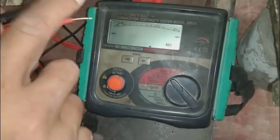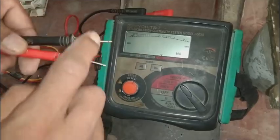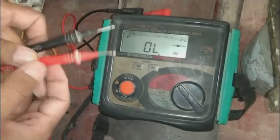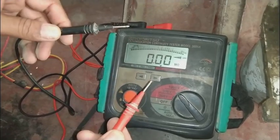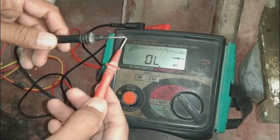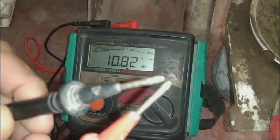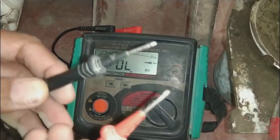While testing on 500 volts, do not touch the probes — this is a safety point. We press and turn the knob; now it is ready. If we connect these probes together it will show zero, and when opened it shows out-of-limits. The probes give a little spark and cracking noise, though it may not be visible on camera.